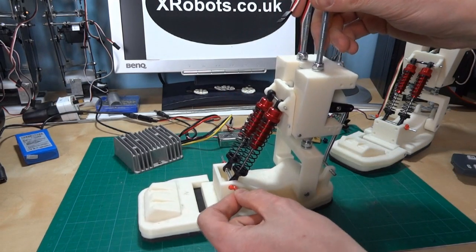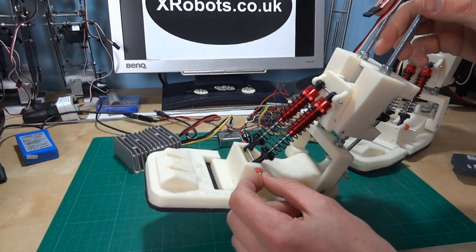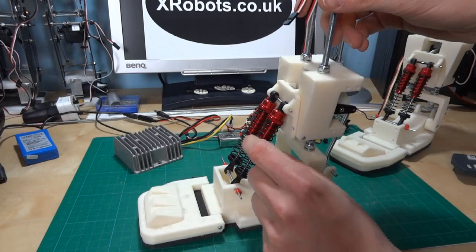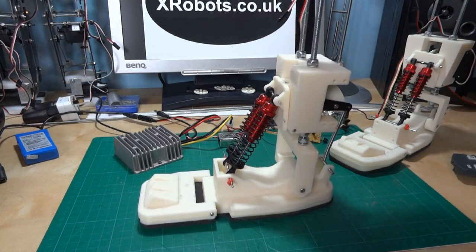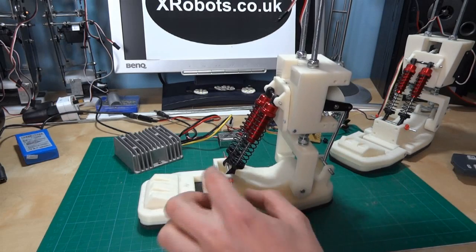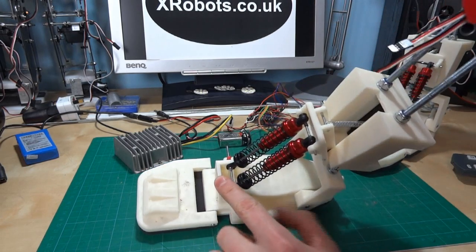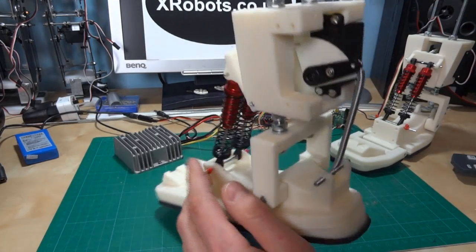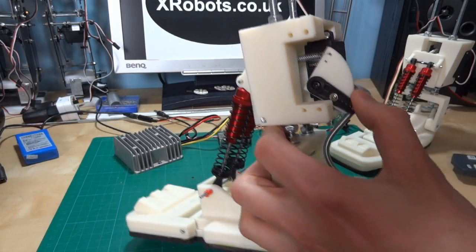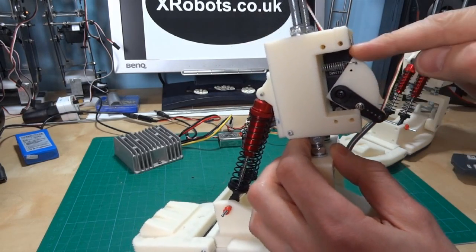I should point out this piece is looser than it should be because I still don't have the M3 studding that should fit in there, so I've got a 2mm piece instead which makes these slightly loose at the bottom. In the last video I showed you this hinge, and you can probably see that's got a spring that attaches it to the servo. I made these custom plastic servo pieces to make a right angle on the servo horn.